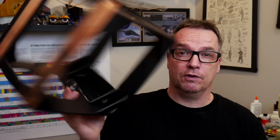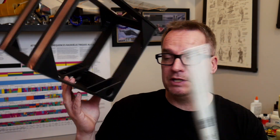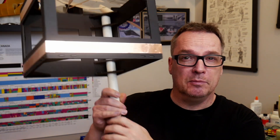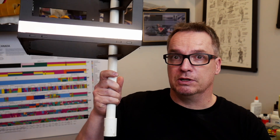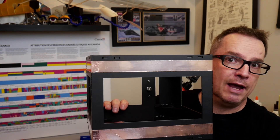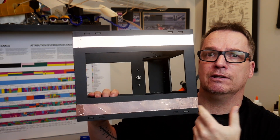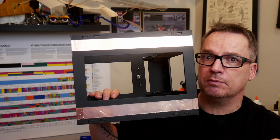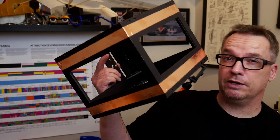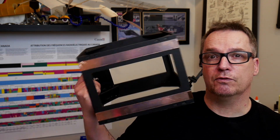How do you mount this antenna? Well, first of all it weighs like zero — it hardly weighs anything. I made holes in the very bottom and this will hold a three-quarter inch PVC pipe that you can place up in there. That pipe can be drilled into the ground or mounted onto a fence post — there are multiple ways to deal with this. It can simply be placed on a table to transmit from, taken out camping, or placed up in your attic or in a room with very little radio noise, and you should be able to transmit quite nicely. All the materials you'll need — copper foil, foam core board, and everything — will be linked below.